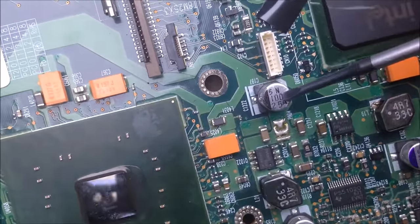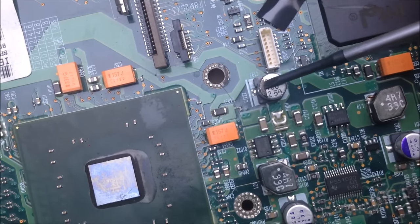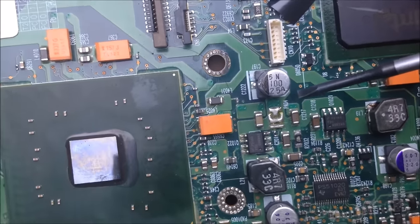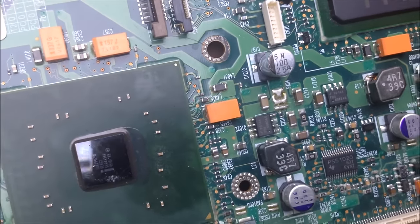You cannot use an electrolytic like this, which is a small electrolytic capacitor. On here, I believe this is still your negative side. This is not a bipolar capacitor either, so it cannot be used for the resonant capacitor.